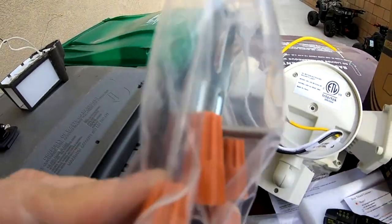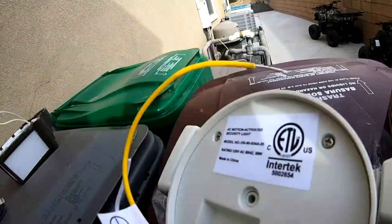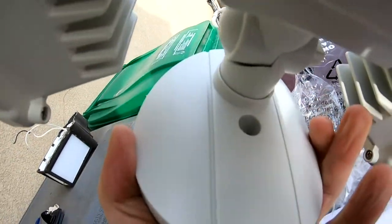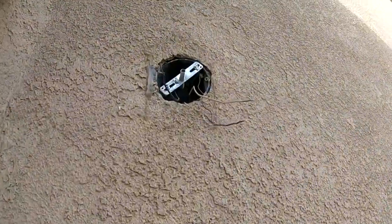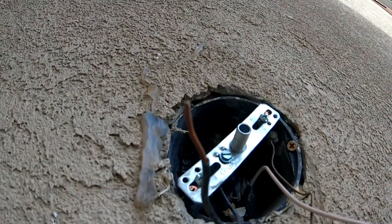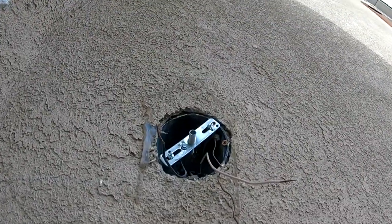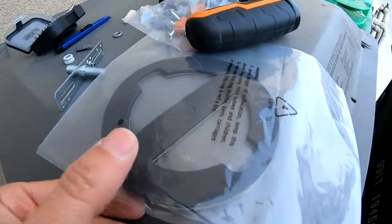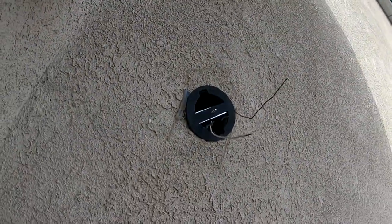Taking a look at the mounting bracket, it has a small screw in the middle. This is to seal the light against the wall. Looking at the existing wall bracket, it has a large threaded piece in the middle that will need to come out and be replaced with the new one. There's a screw on each side of the bracket — undo these and put the new bracket on. In addition to the new bracket, I'll put the black round weather stripping on, making sure the wires go through the holes and not the outsides.